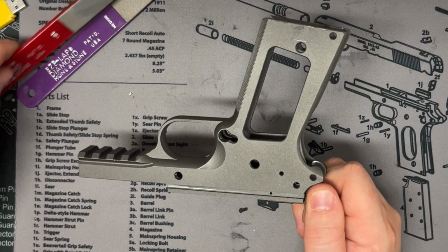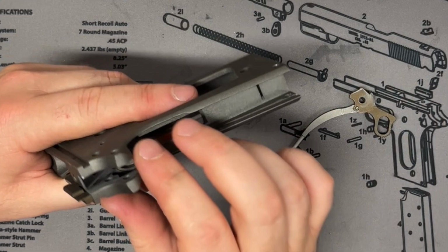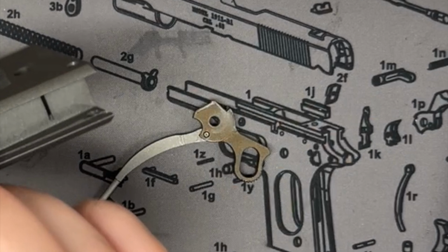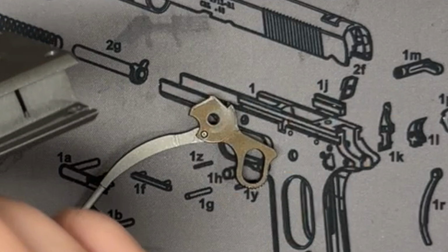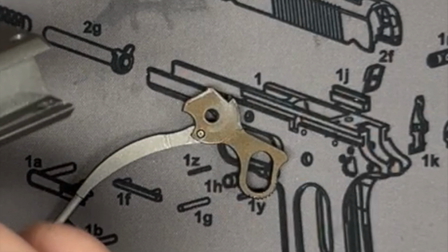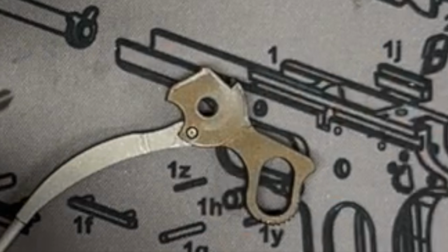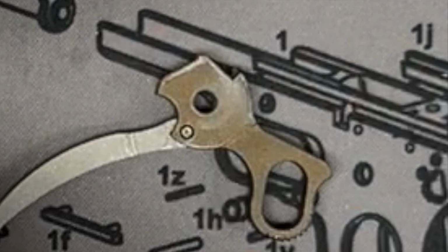The other thing I learned is I need to reevaluate how I spray Cerakote on small parts. So for this build, there were a bunch of small parts, and I bought and used one of those multi-alligator clip hangers. And what that did is it didn't really allow me to get in and treat each part independently how it needed to be treated. So as you'll see here in footage from a previous episode, I've got thickness problems out towards the edges. I guess Cerakote is one of the types of paint that runs towards edges. There's other types that run away from edges, but you'll see that I do have thickness problems at that edge. So either I need to paint these small parts individually one by one and then put them back on the hanger somehow, or I just need to learn how to use that hanger thing better, but something to note.